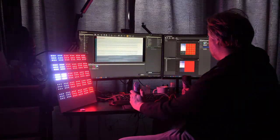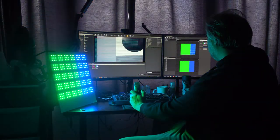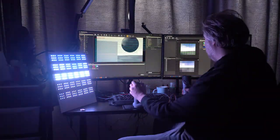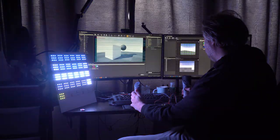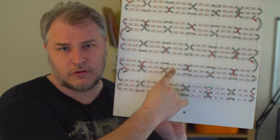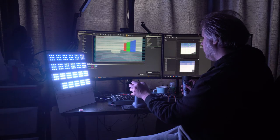However, even though we've got a really fast microcontroller, given the latency of encoding and decoding the strings and sending it between, it would never get to the very end LED on this board, right? It would maybe kind of make it halfway through, or it wouldn't illuminate them all, or it would illuminate them all, but it wouldn't hold them on. And as a result, the board just wasn't stable.